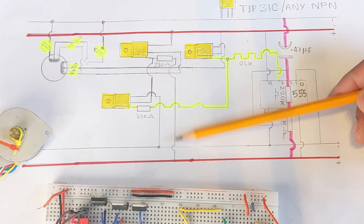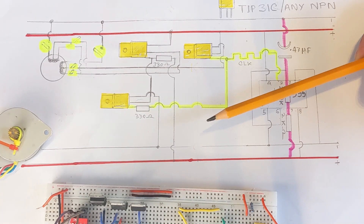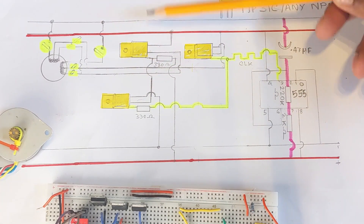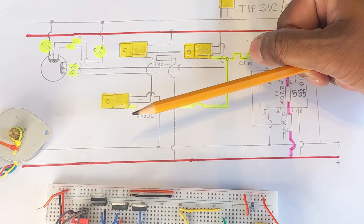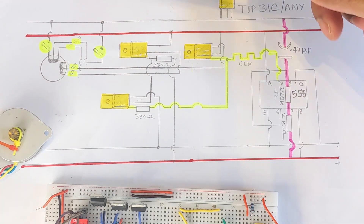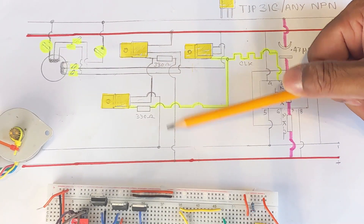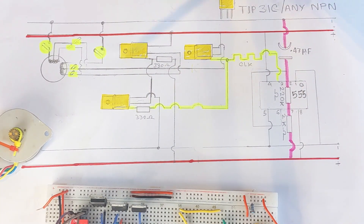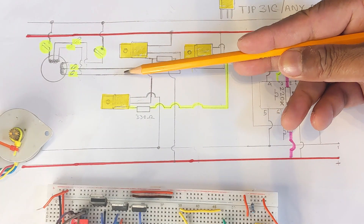The base switch is always on — as you can see, it is connected with the positive rail via a 330 ohm resistor. So this transistor is always on and is supposed to get power always, but I put an interruptor. We all know that electricity follows the path of least resistance, so I used another TIP31C transistor connected with the ground. Anytime there is voltage on the base, this ground connection activates, which prevents any voltage going to this transistor, so this coil will not get any power.